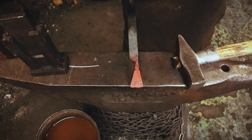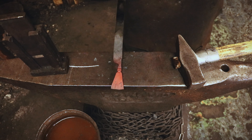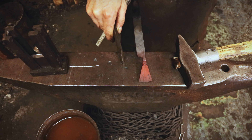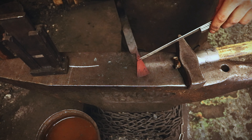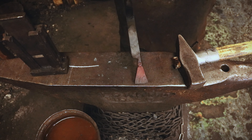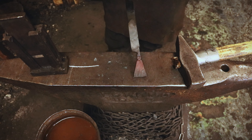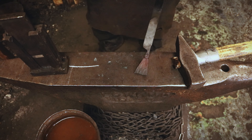I'm going to forge the loop out of a separate piece, a three millimeter wire. I have this guillotine — this kind of dice — so I get a groove here where the three millimeter wire will fit. I'm going to wrap it around and hold it still, then do some forging at the bottom of the pendant and then engrave the rune.